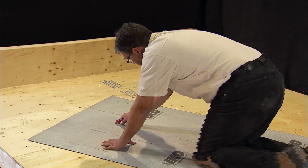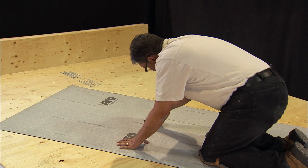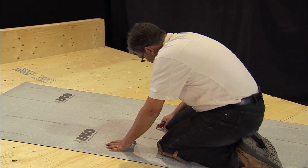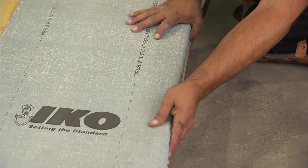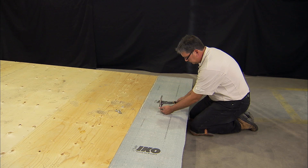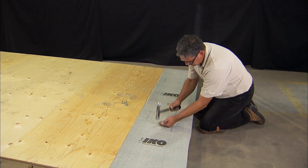To begin applying the RoofFast system using the RoofFast Base MA, start at the lowest edge of the roof. Prepare a starter strip by cutting the base sheet lengthwise in half and lay flat on the clean, dry deck. Leave a minimum 2 inches of base sheet overhanging the roof edge to cover any exposed joints in the wood fascia where water could penetrate. Fasten the RoofFast Base MA at 18 inches on center in a row down the approximate center of the starter sheet.